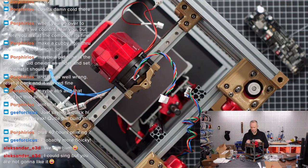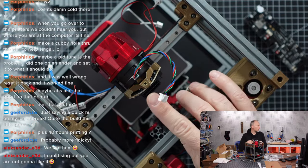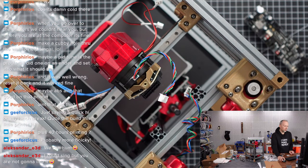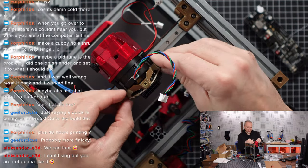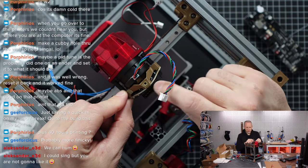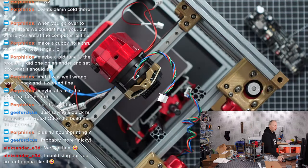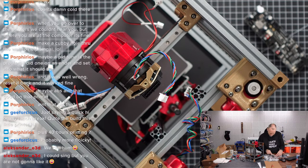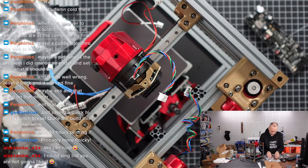It's facing up this way, and here's the connector. Use the V groove at the top for proper alignment. Very much you cannot misalign this because it's just going into this little groove here, as they call it, and you cannot be going wrong, honestly. Now we have longer screws, M3x12, and washers that we need to fix the PCB.